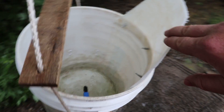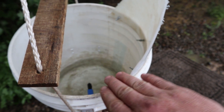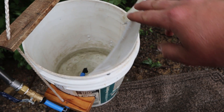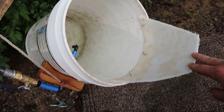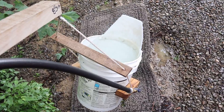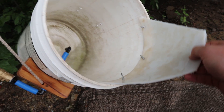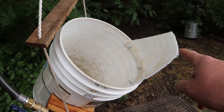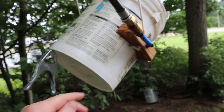I had to add this additional tongue here because it would fill up and I don't have enough water flow to make it tip over rapidly — it would just kind of dribble over the edge. But if I added this, it would tip and keep filling and tip and keep filling until it tipped far enough to dump. This shape is actually reminiscent of actual Shishi Odoshis that have that pointed tip on the bottom side. I have the clamp on there because sometimes it just sticks a little bit too far down that way and it won't fill up.